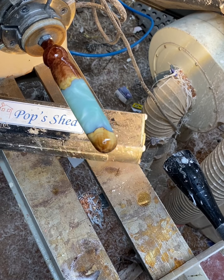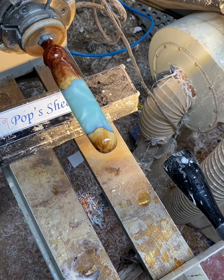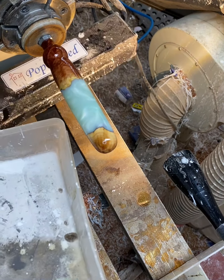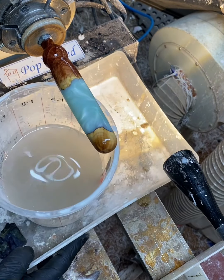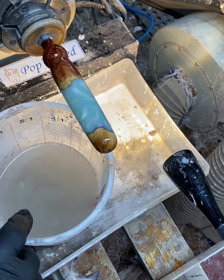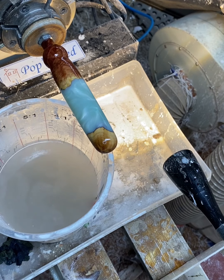Now, if you're doing wet sanding on your lathe, you probably see there's quite a bit of rust on my lathe bed, but meh. I strongly recommend sticking a tray underneath where you're wet sanding. Catches a lot of the water. Now, if you remember, before we started applying our CA finish, I finished at 600 grit. Now that's where I'm actually going to start sanding.